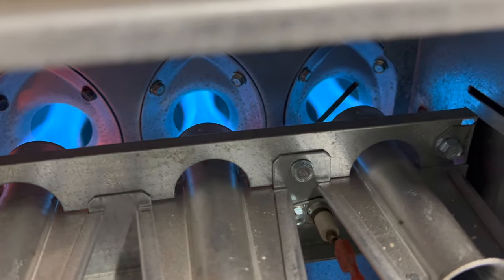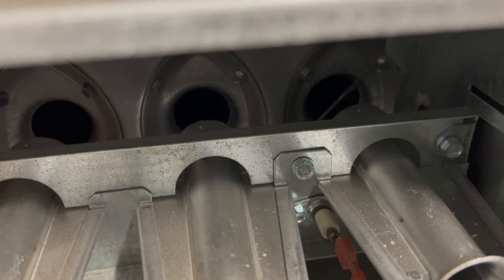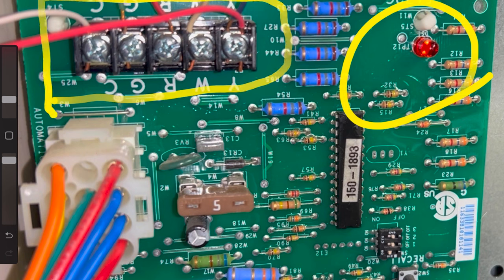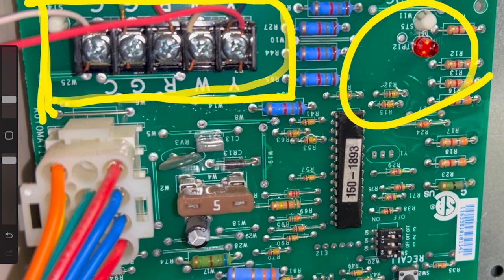We had to finally get an HVAC company to come and look at it. When it was all said and done, it turned out to be a problem up here with the Nest thermostat. The only reason the technician knew about this was that he had had similar problems with other Trane furnaces with their Nest. They always thought it was the circuit board, and they were replacing whole circuit boards and still having the issue. Eventually they traced it down to this wiring setup, and I'm not really sure what it was, but something like that was wrong, and that's how they ended up fixing this.